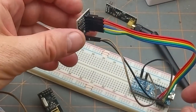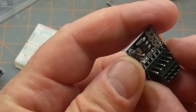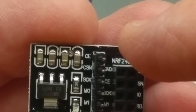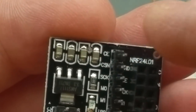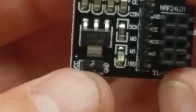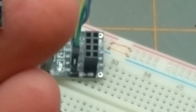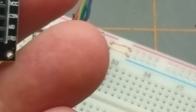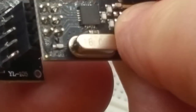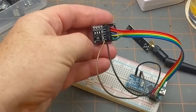Since these things won't come to the breadboard, I've had to make the breadboard come to them by wiring out the eight pins. Let me grab another one so we can see what the pins are labeled: CE, CSN, clock, MOSI, MISO, and IRQ, then VCC and ground. You can see them labeled on the adapter board as well. The pinouts are the same on both module types.